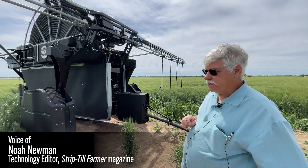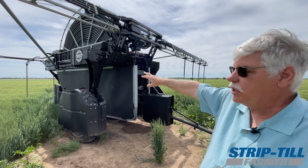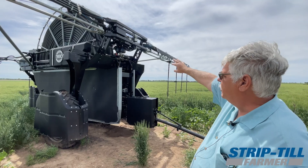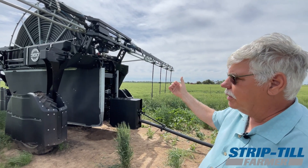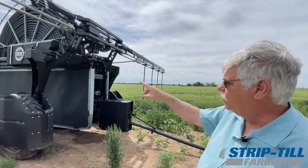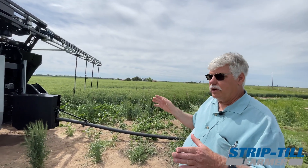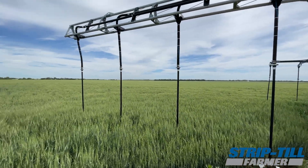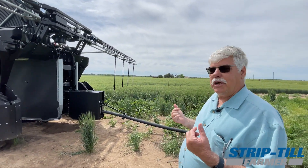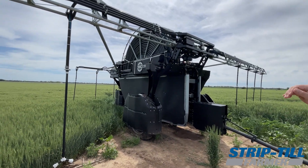Can you explain how it works? Well, you've got a 26 horsepower diesel engine on the front, which is basically running a generator because the wheel drives are electric. It does have a little hydraulic system for the steering mechanism and opening and closing certain lines on the back. It moves through the field, uncoiling the hose which is hooked up to the pumping unit. As it goes forward, the outside three drops on both sides will drop water. When it gets to the end of the field, it will back up following the same path, and then the six inside drops will drop water.